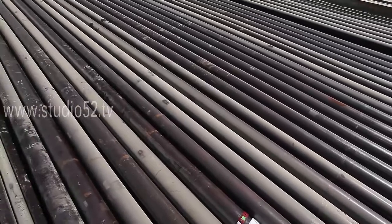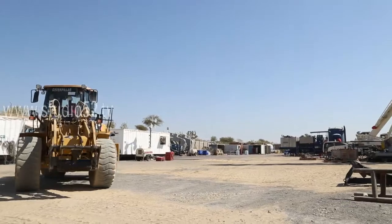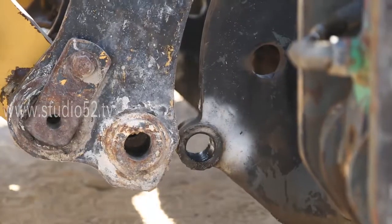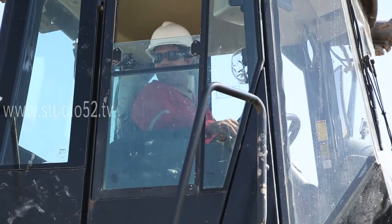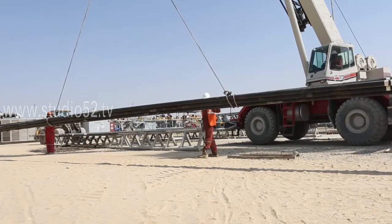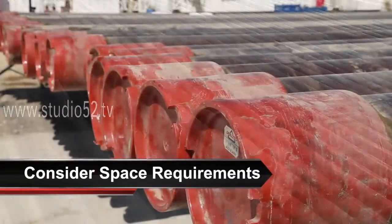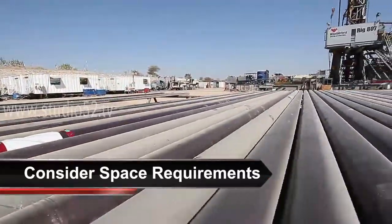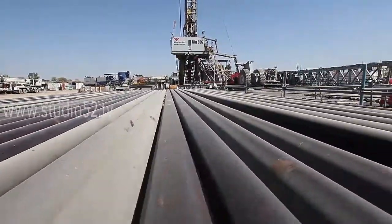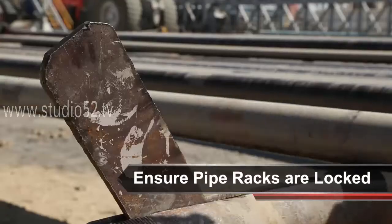In this section of the video, we'll cover the unique requirements associated with handling tubular pipe. While unloading casing, the crane, loader or forklift must be operated by a competent and fully licensed operator, and a dedicated signalman or spotter must be used. In determining space requirements for casing, consider whether there is reduced or limited space that may cause the lift team to be unable to immediately lower the tubular pipe. When loading pipes onto a pipe rack, ensure that they are locked into position to prevent rolling.